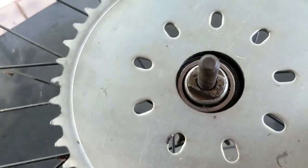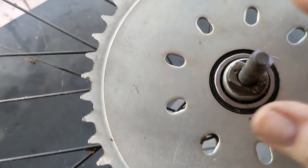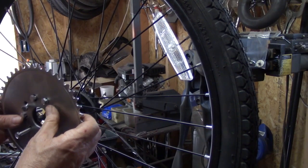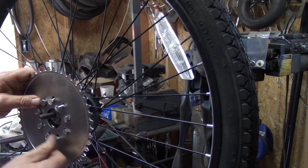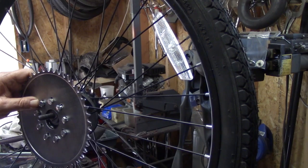You've got your dead-nut centerline of the axle and then you've got the dead-nut centerline of the hole in your sprocket. If you have your sprocket mounted off center, it's going to rotate egg-shaped - you get the weeble-wobble thing. That's no good.